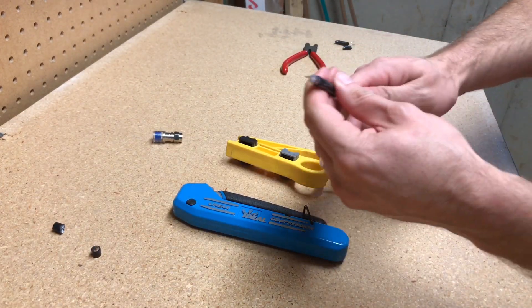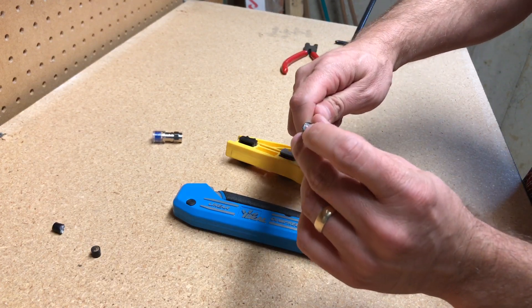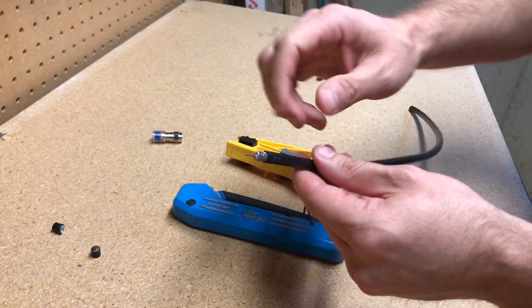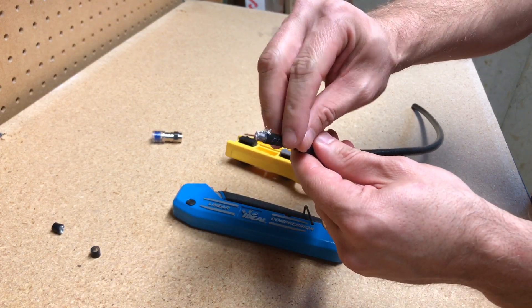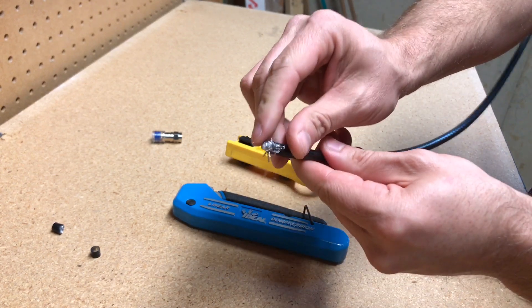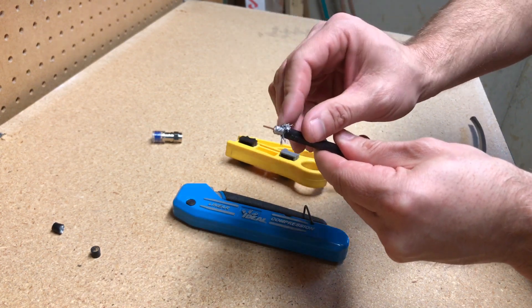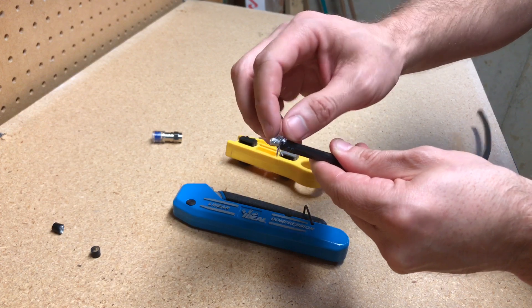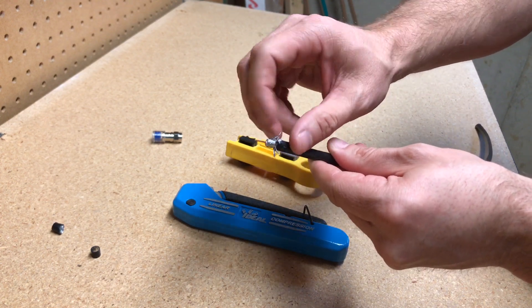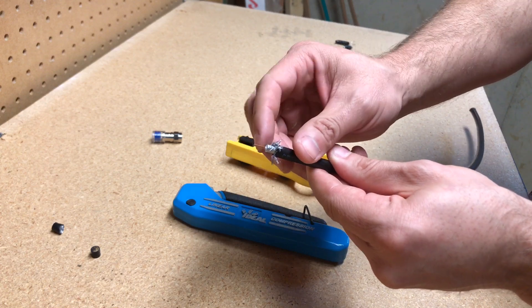Let's go over some things you need to know about this cable. Once you get the rubber sleeve off, you've got the braiding, the foil, and then the white stuff — it's a plastic composite called the dielectric. What's really important is you want to take this braiding and peel it all back, getting it away from the foil. If you don't get it all back from the foil, it could be wrapped around the copper-plated part, and it could be sticking out of the connector. If it's wrapped around the copper part, those little braids can pick up RF signal from the air and put it right into the line and contaminate your whole line — and you'd be worse off than when you started.